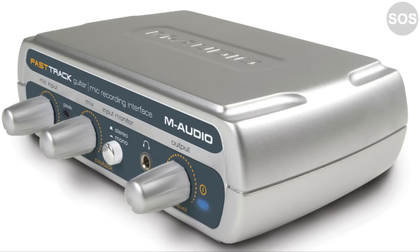Those two interfaces run between $130 and $200 new, but you can find them used as well. One thing to watch out for: if you're looking at the older Fast Track with just a single input on the back in a slimmer box, that unit does offer a mic input but does not offer phantom power. Make sure you get the Mk2 version for that lower-end interface if you want to use condenser microphones. I'm always a fan of stepping up a little more than what you need from the start, so you always have gear that won't outgrow you.